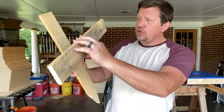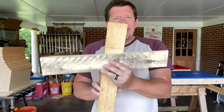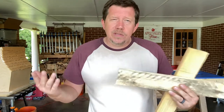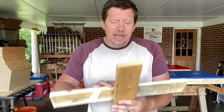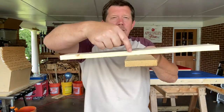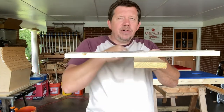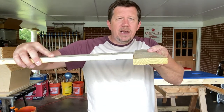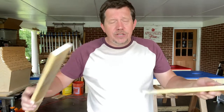We've got two pieces of wood we want to join together — I'm going to make a little cross actually. I could just nail these pieces together and that would be okay, very rustic, and this is pallet wood. But I'd like to take it just a little step further and refine it by doing a half lap joint. That means I'm going to cut off half of the material on the bottom side of this piece and half on the top side of this piece, and when they join together they will wind up being flush.